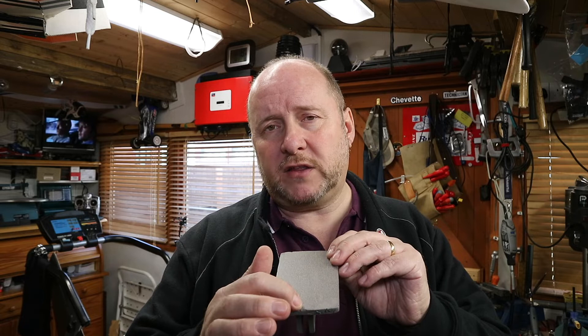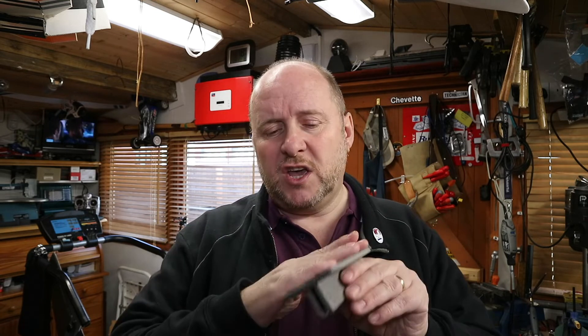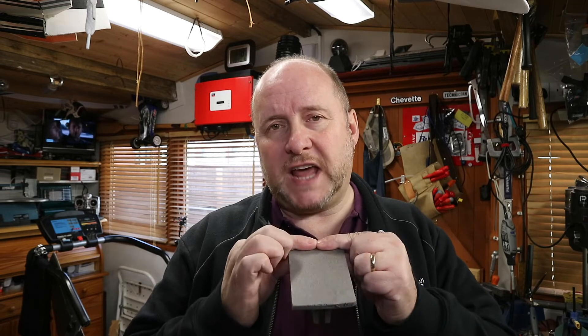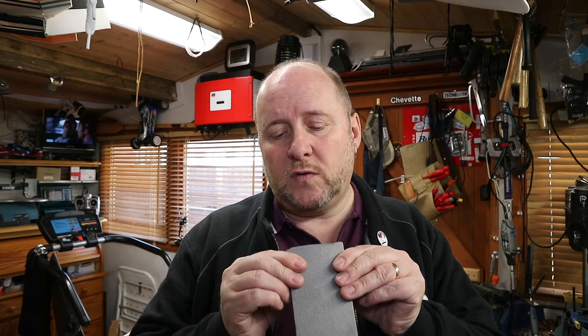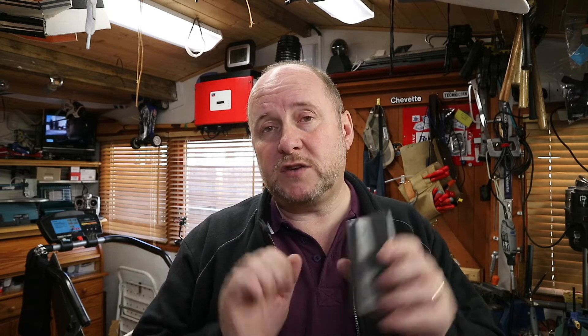You can cut it, sand it, and bend it. There's a technique to bending it — if you try to bend it directly it will snap because it's quite dense and the tension will cause a crack at the top. To eliminate that, you cover it with packing tape or masking tape, which holds the surface tension so instead of cracking it will wrinkle on the inside and hold firm.